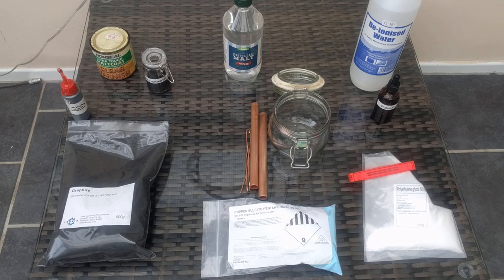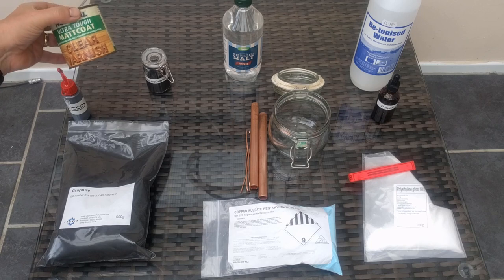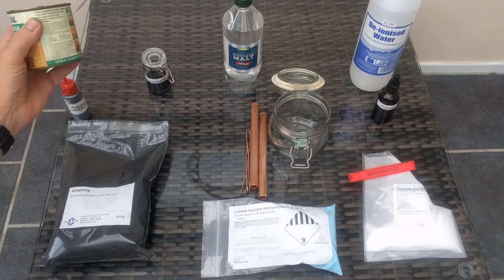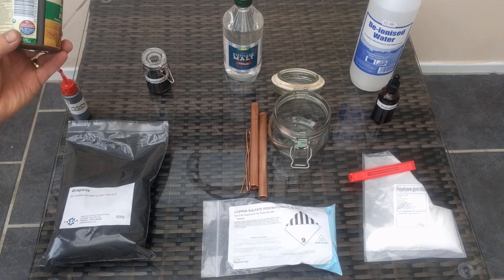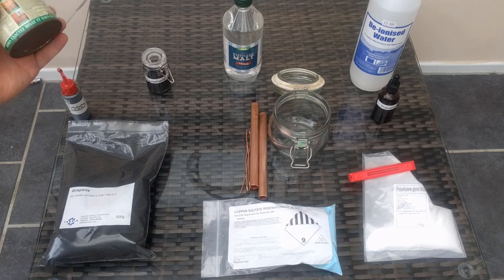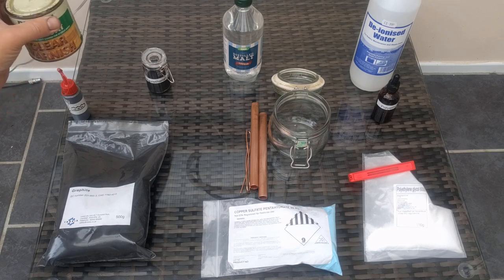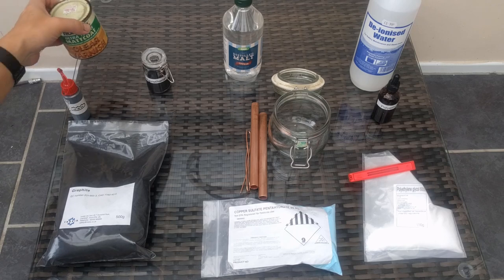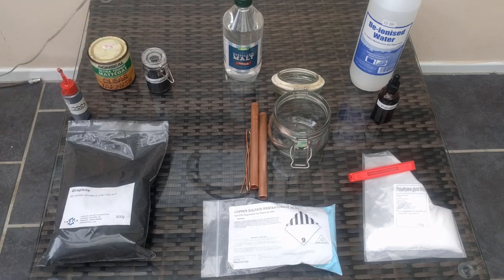On the left are the components for making up our polyurethane graphite conductive layer. I'm using a polyurethane varnish as mentioned — you can use anything really, but the newer versions tend to be water-based, so be aware of that. This is a VOC one, meaning it's solvent-based, which I think is much better. You've got much more chance of it surviving in our solution than a water-based one, which may bubble up and do some weird stuff.